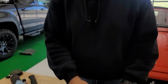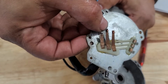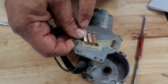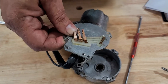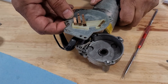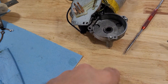We cleaned it all up and it looks pretty decent. We think there may be a missing little nipple on here for our contacts. The idea is that we clean this piece up, which we have already done, and then try to solder a little nipple back on there — that hopefully will help us out. From there we'll grease it up, clean her up, and give her a test run. We're going to have to do some self-tapping screws here too.